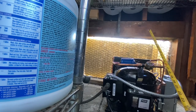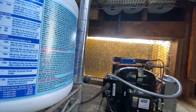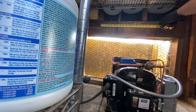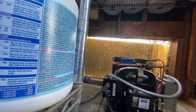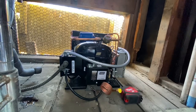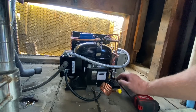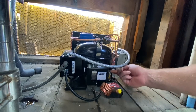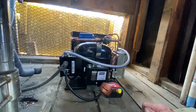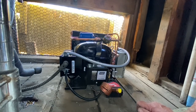I'm going to come up 18 inches, and then come back over around 15. Let's see how that works out. Another NorCal tip of the day — I haven't bolted down the condensing unit yet, because I need to make this braze down here. I'm going to use my tape measure as a kickstand, put the condensing unit up on the tape measure, put my wet rags around so I don't catch any of the wood on fire, and it'll be raised up so I can get to the bottom of it.